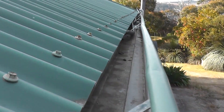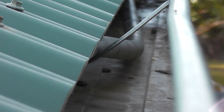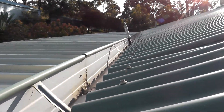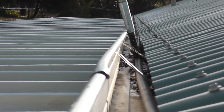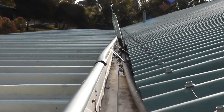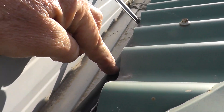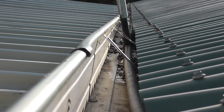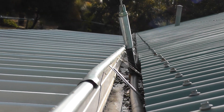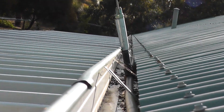To run the water around the house we've simply used 19mm irrigation poly pipe, which goes along the roof to the sprinklers. People have said to me aren't you worried that the poly pipe will melt — my answer to that is it's sheltered from the radiant heat by the gutter, it's got cold water flowing through it, so I think if that melts then we're in a lot more trouble than just trying to stop the house from catching fire from a bushfire attack. Anyway, that's the system I've got — we've had it for eight or nine years now and thankfully we haven't had to use it.